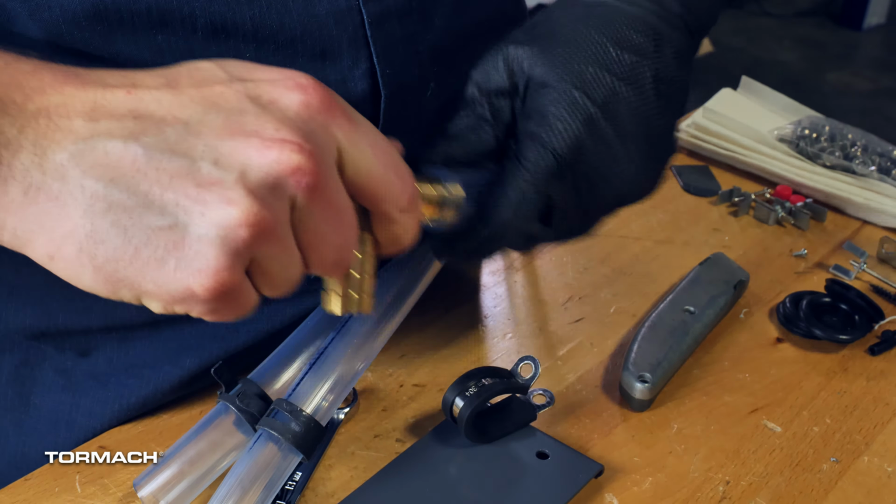Slide on the hose clamp. Connect the loose end of each remaining hose on the T-fitting to the barb fitting on either side of the enclosure with pliers and a hose clamp. Plug the pump's power cable into the washdown coolant power outlet on the side of the electrical cabinet.